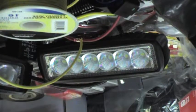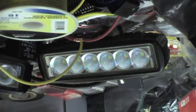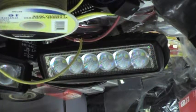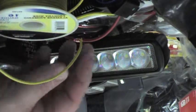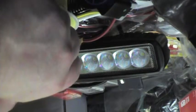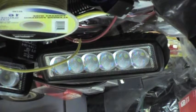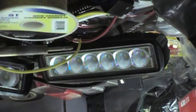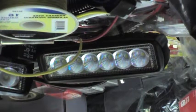The intersecting wire is yellow — that's because of the color code I'm assigning to my circuit. Yellow is the wire color that's going to feed the trigger for the relay. I wrapped this according to NASA's standards: I took the wire, stripped it back a little over an inch, and then wrapped five wraps around the main wire we're intersecting. I've preheated my soldering iron and we're going to use it to preheat the joint area.